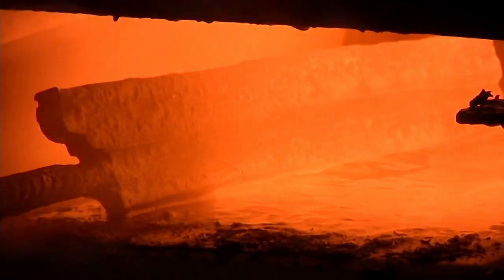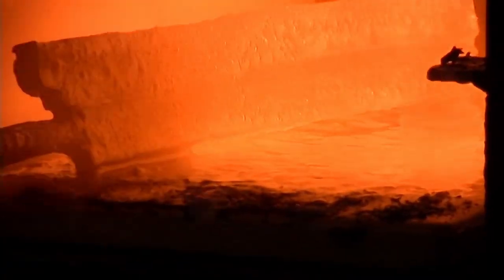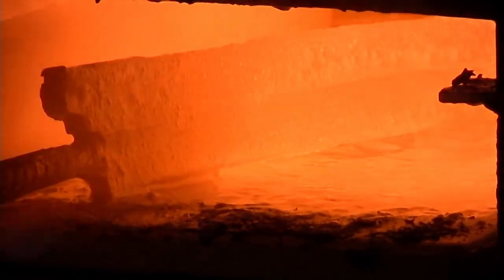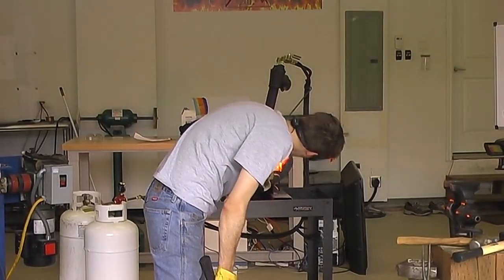So what I'm going to do is have the six-layer billet, the spine, on the base of the anvil, and I'm going to be hammering on the edge, because if there's a little divot in the edge billet from a hammer blow, that's not a big deal. But if it happens on the spine, that'll show as a deformation in those layers.